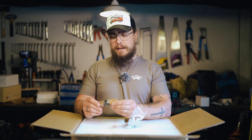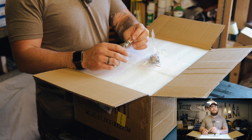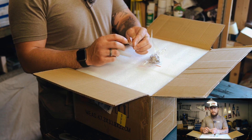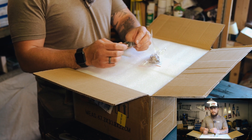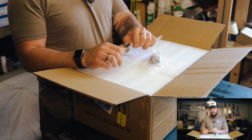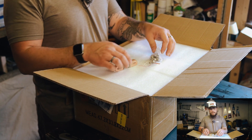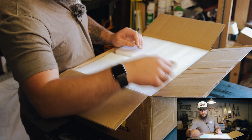Straight off the bat I am very impressed with the bus bars they've given us. These are very similar to the bus bars I got with the Winston cells I use in my van - basically layered bus bars made of multiple pieces of copper. There are five copper sheets here, giving you a very good cross section for the connection. It's also flexible, so you can flex all four bus bars, which is quite nice. As the cell expands and contracts even just a few millimeters as it charges and discharges, these are very good. And then some standard 8mm bolts for those - looking good.